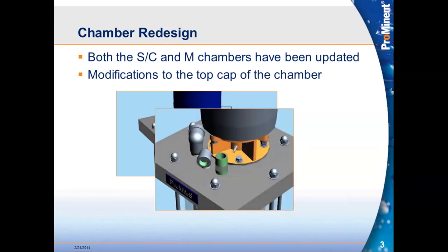The PROMIX C was even worse. Because of the smaller real estate available, all three connections were crammed right next to each other — very tight. It was difficult for our assembly staff to build it, requiring things in a very specific order. They still had to thread a metal fitting into a plastic top, and threading too much risked cracking the plastic.